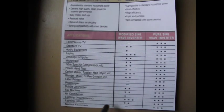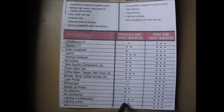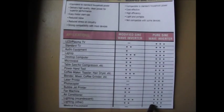Other lighting — this could be LED lighting or fluorescent lighting, which is not really working off of an element — gets two stars for modified sine wave. Some of it may work okay, some may not. It may not be as bright, it may flicker or flutter like a strobe light. Fluorescent lights take an electronic ballast, and modified sine wave is probably going to interfere with the electronics within the ballast. Under pure sine wave, perfectly okay, three stars.